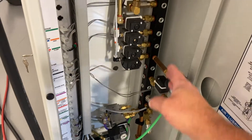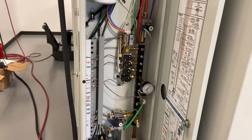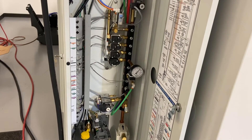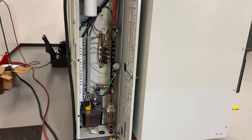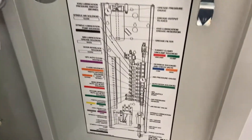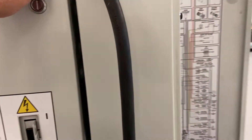This panel right here is the complete air solenoid assembly, so every air solenoid is right in this area of the panel. The solenoid valves are no longer exposed to the machining enclosure, the coolant mist, and things like that — so it's a much cleaner panel, really nice for the service guys. Everything is clearly labeled as well; every airline and every function of every solenoid valve is right there where you can see it from the panel.